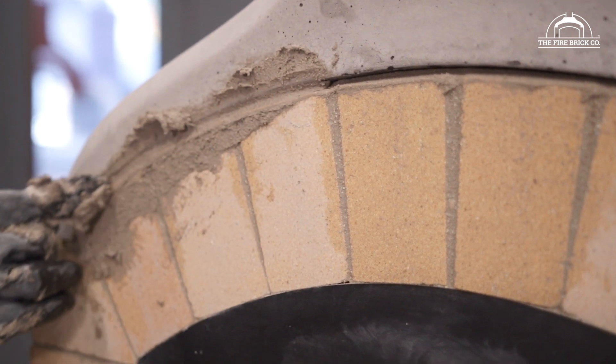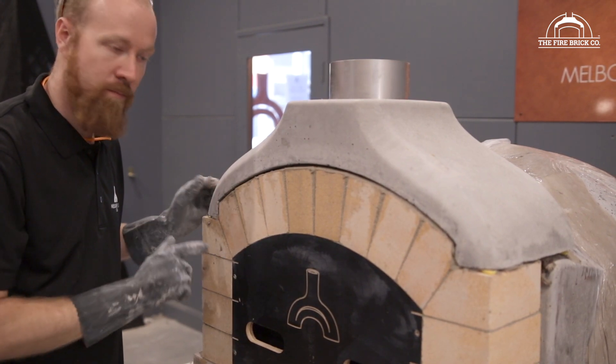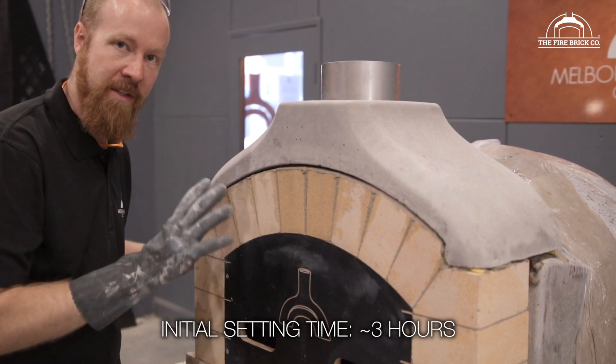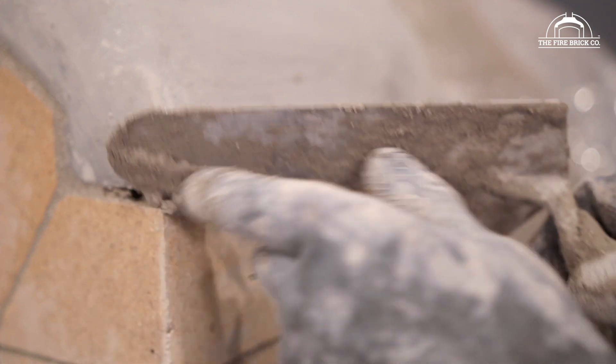While we've got the mortar mixed up, we're going to fill in this joint and fill in any other little joints. We're going to leave our plastic spacers in for now until this mortar takes its initial set, and then we can pop them out and touch up the holes later.